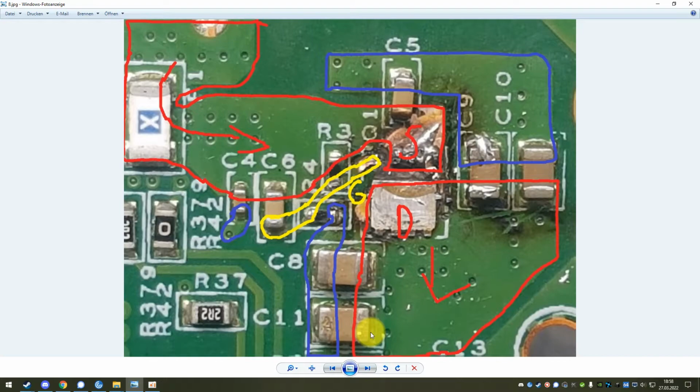So after I explained the inrush current limiter in principle, here is another picture of the failed device in the USB-C docking station, which the trace is drawn onto. So what's basically happening is, on top here is where you plug into a charger. So there's your 20 volts coming from. So red is always the 20 volt line, blue is ground.